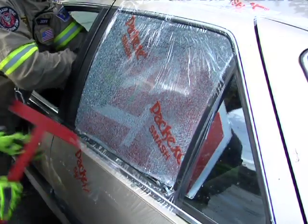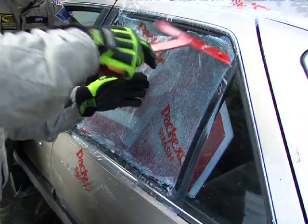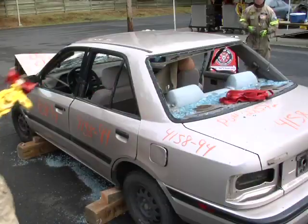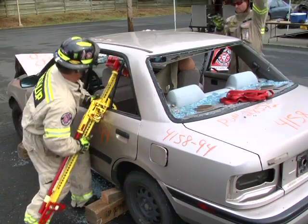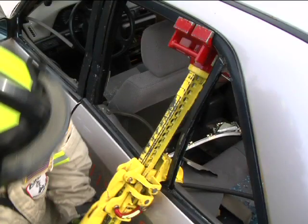Next, remove the glass from the vehicle, then strip the interior of the upper B-post, exposing any hazards. With the reversing latch in the up position, place the first responder jack in the rear 1/3 of the door frame of the rear door window.